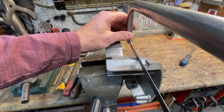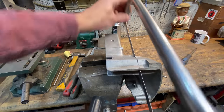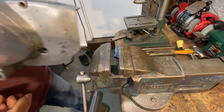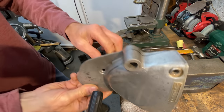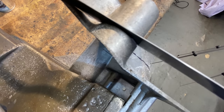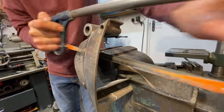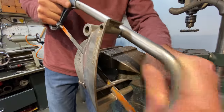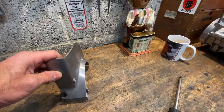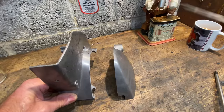This can be really difficult to grip in a vise, but I manage to grip it on one of the internal protrusions and start cutting. The cast aluminium cuts really nice and I just guide the blade to cut a straight line. Then I turn the casing round and start from the bottom, meeting in the middle with the cut. That's it in two pieces, so now I can extend its width by 48mm by inserting a piece of aluminium and welding it in place.